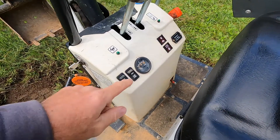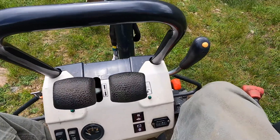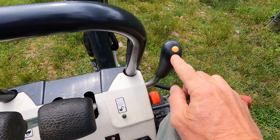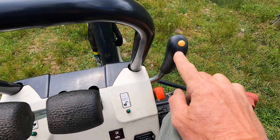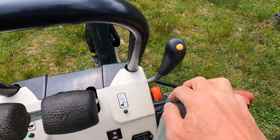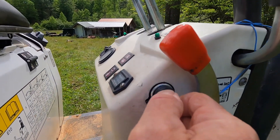I've done a whole other video on how to expand and retract the tracks on this machine, so if you look on my channel you'll find that. Getting back to the console, we have the fuel gauge and some trouble lights — oil pressure, water temperature, battery, etc. This little yellow button on this stick here is for the two speeds of the drive motor. You use normal drive when you're tracking and working, but when you're tracking to another location you press this button to go a little bit faster. It also tells you how many hours you've run the machine.